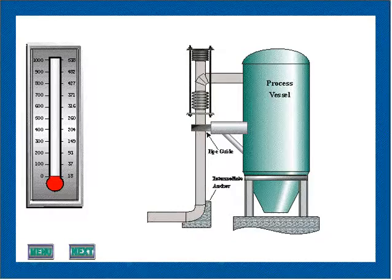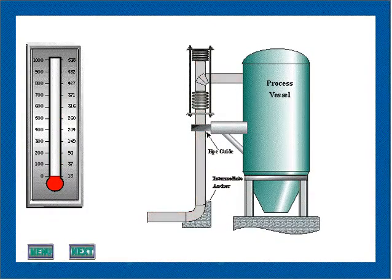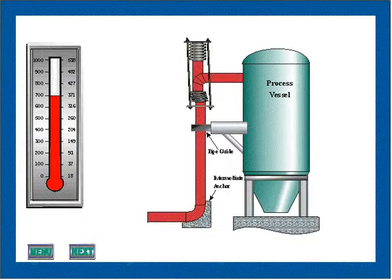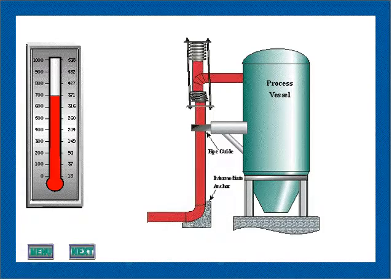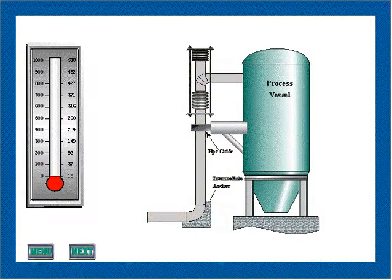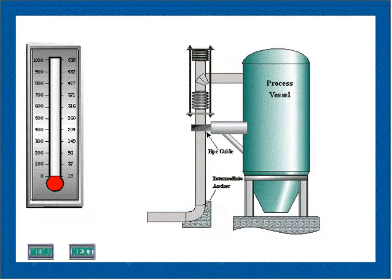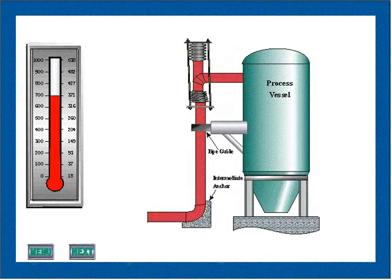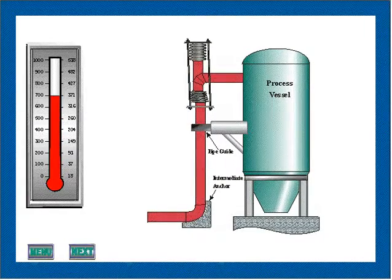In many cases, external structure is not available at the upper elevation of the process vessel, and the guide must be connected to the vessel itself. Using this arrangement may result in some bending load upon the piping, especially where the vessel is tall and subject to wind loading, deflection, or similar effects. Where the guide is attached to a rigid external structure, the expansion joint must be designed to absorb wind loading, deflection, and other similar loading as lateral deflection.